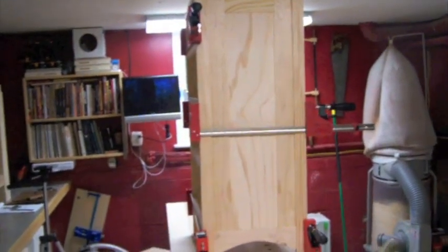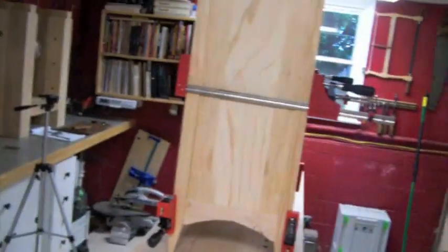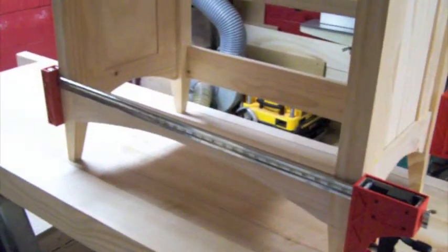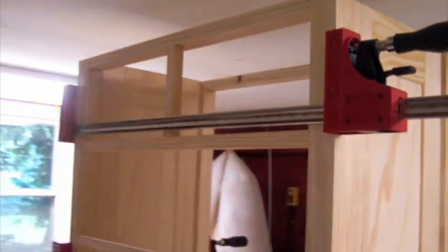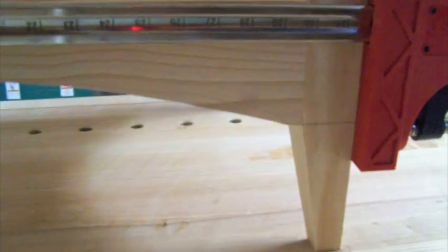Here's a good look at the side of the bureau and the frame and panel setup. You can see the frame is just set into the four corner posts, attached with biscuits. Here are the different reveals — I really like the shadow lines they create. There's a gentle curve cut into the bottom rail, and each drawer blade is set into mortises with a divider between the top drawers. Really very simple carcass construction. You can also see the taper on the bottoms of the legs.